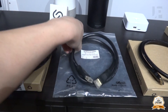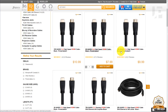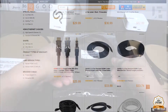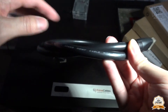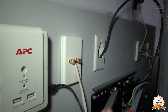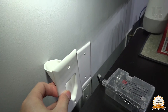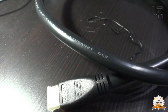This third HDMI 1.4 cable is slightly thicker, and this is due to its fire protection rating. This cable comes in lengths from 3 feet all the way up to 100 feet and also comes as a flat version. Taking a look at the jacket, it says CL2, which means class 2, and it's rated to be installed inside the wall. If there's a fire, this jacket and cable won't allow the spread of fire via the cable. If you're ever running cables inside the wall or using a pass-through, you need to use in-wall rated cables — CL2, class 2 or better cables.